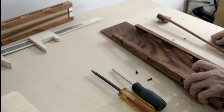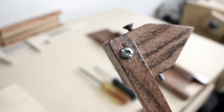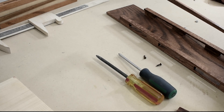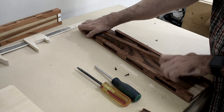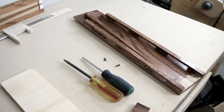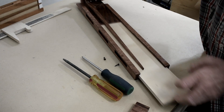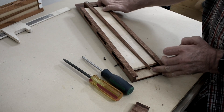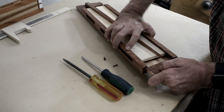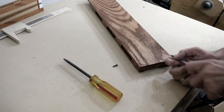I stained the whole piece and now I can put it all together. You can see the lead weights I put in here and also the screws. This one screw is going to fit in here and I'll just put a small washer on there and put a nut to hold it in place. Now I can put in the spruce strip like so, and this will be a stop block. The block goes in, and to secure it I'll just put in two small screws into the back.